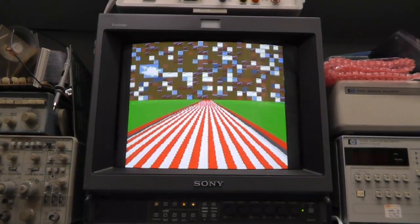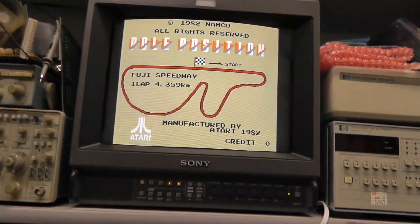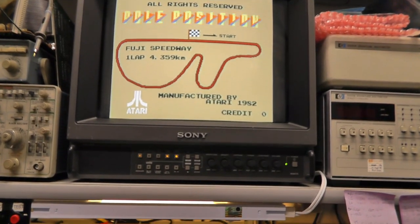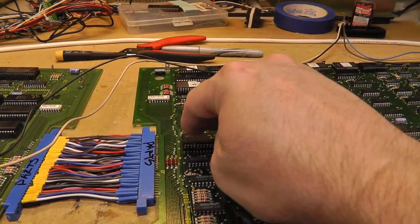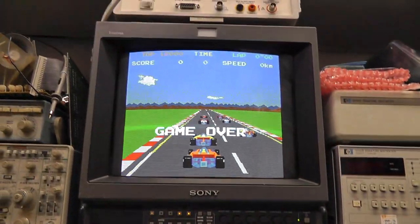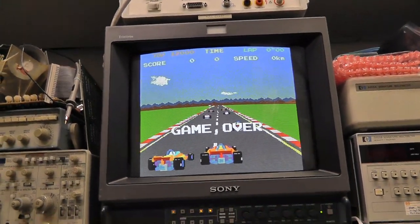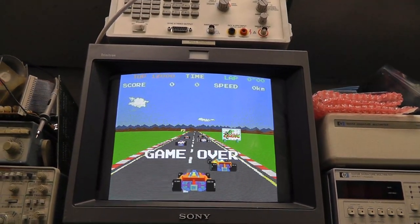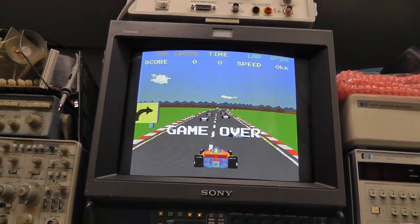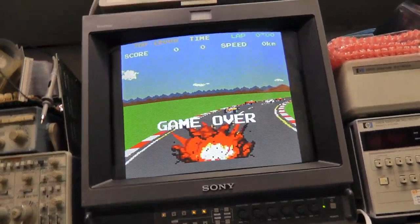We're getting it to boot but it's shaking a little bit, which is weird. There we go — that was 2F. I just pressed down on 2F and re-power-cycled it. It seems to be working, but we did get a different RAM error: RAM 51.